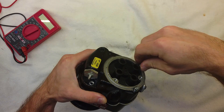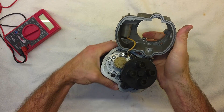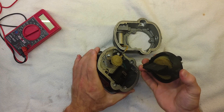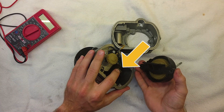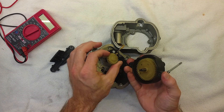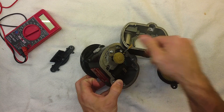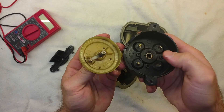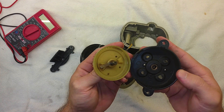Let's go ahead and pop this open. Four little screws hold the back of this thing on — we'll take that off and look inside. We'd also have two more screws holding our distributor on. Inside we can see a coil of wire — this is where the spark comes from. It touches that little part on this rotor, and as that shaft turns from the engine, it also turns that gear on the inside, which spins another gear. That gear has a little piece of metal that connects to the four ports for your spark plug wires, distributing the spark to the proper plug at the right time.